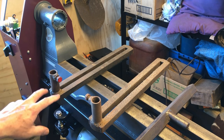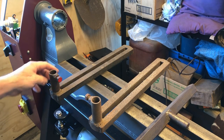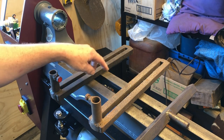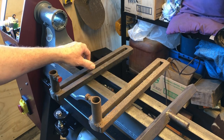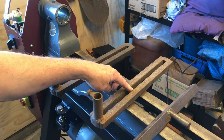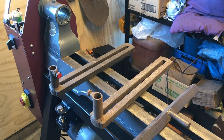When I bought this lathe it came with these two — they look like homemade banjos, just a bit of pipe welded on a couple of bars that are joined at each end. Those are three-quarter inch or around about 19 millimeter solid steel bars and they have a gap in the middle. That's where you would put a bolt, and there would be a plate that fits down inside your ways, and then you would tighten that bolt up — that's how you would secure it. Tightening up the banjo with a bolt and using a ring spanner or socket is a little bit cumbersome and time-consuming.